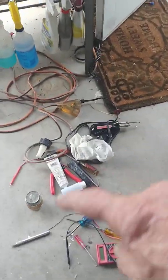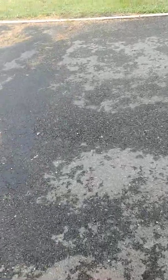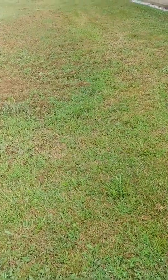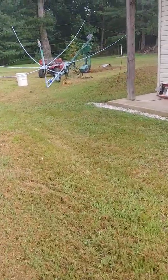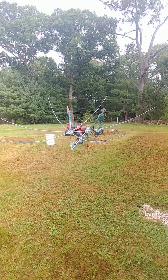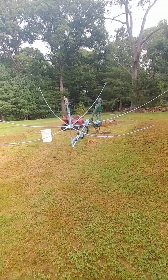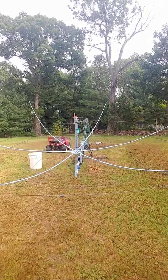Video number two — it all came together after a while. I was pulling out what few strands of hair I had, taking this thing apart over and over, finally realizing the problem wasn't in the controller, it was in the power cable. At that point I had taken the magnets out and turned them around without noticing, so the safety limit switches that control the motor worked backwards and I couldn't understand how it could work backwards. Sure enough, old me had flipped the magnets.